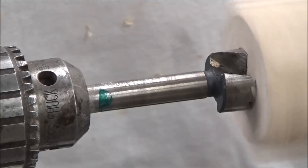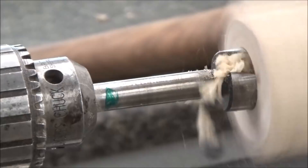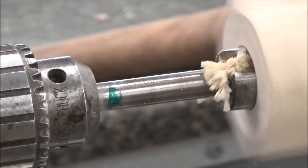Running at about 800 RPM. Take this slow — if the ash has particularly open grain, the drill may want to wander depending on the wood; you might want to drill a pilot hole first. Feed this in nicely, clear the lands, make sure the lands don't plug up.